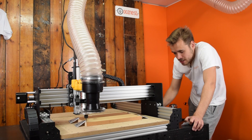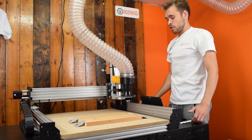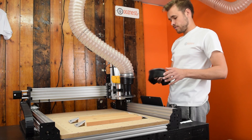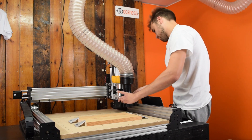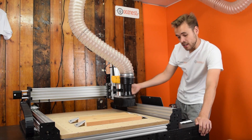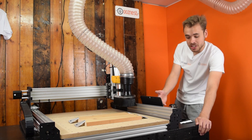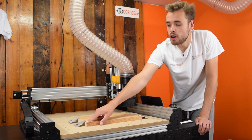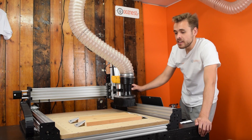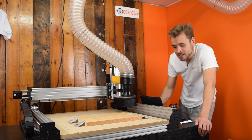So now I'm going to re-home the machine. I'm going to put the dust shoe back on. So now the machine is homed — this again reads minus 3, minus 3 under the Machine Position. And now under Work Position, it reads the coordinates of this corner relative to the home. So now for instance, if I want to go straight back to this corner, I press the Return to Zero button.